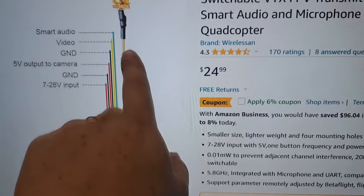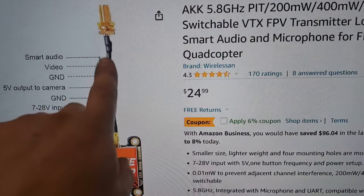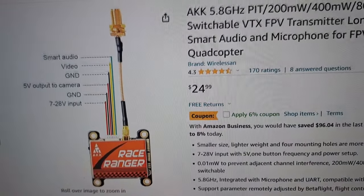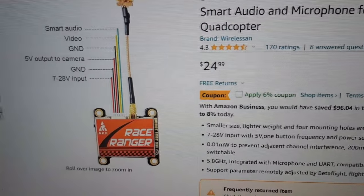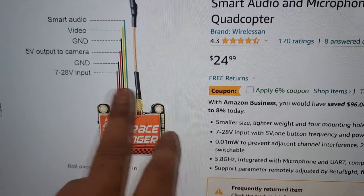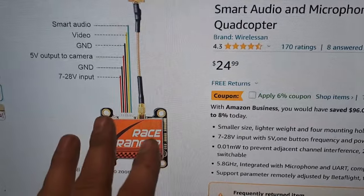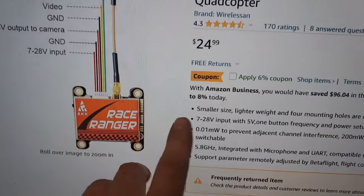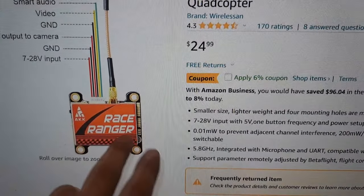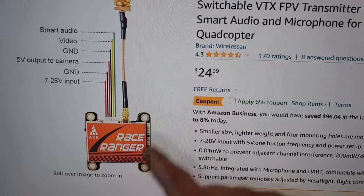This VTX has an audio channel, but it's actually a control combined with audio — you're supposed to be able to AC-couple your audio in so you can transmit audio while also using a protocol to control the VTX. If you don't use that protocol, you might get an external mic going, but you're dealing with sub-carriers. These VTXs run on 6 or 6.5 megahertz. The built-in mic is made for drones and the audio quality just isn't good for RC cars.